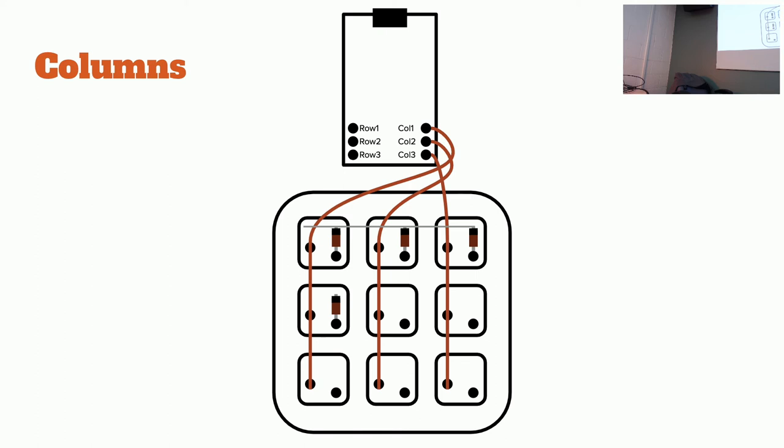So one technique, if you wanted to, you could have them snake. So here you've got to come in this way. On this side, let's go over here, and then on this side, go this way. Ooh, I like that. So now it's kind of more pressed together. Yeah, I like that. At this point, I would actually suggest cut it to the length that you want. Right there, and then strip that end, create a little loop, solder it there. Does that work out? Yeah, it ended up going on that other one. Nice. And now I just got to do this last one. Yep. Just got to get both points in. Yeah, it's a technique. You're learning it.